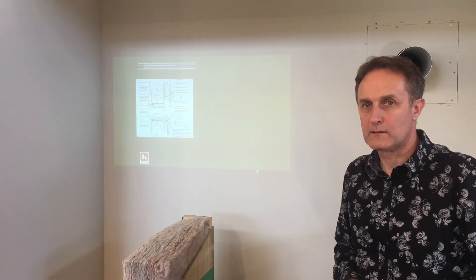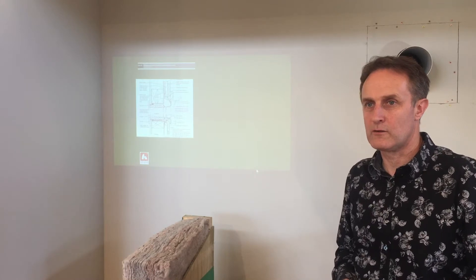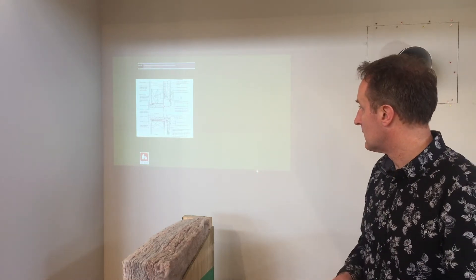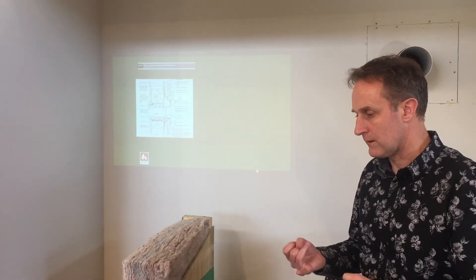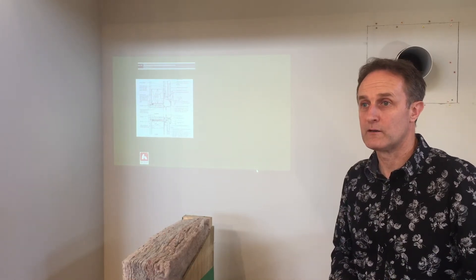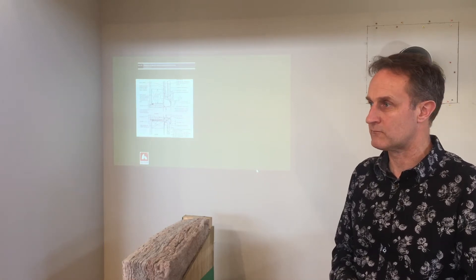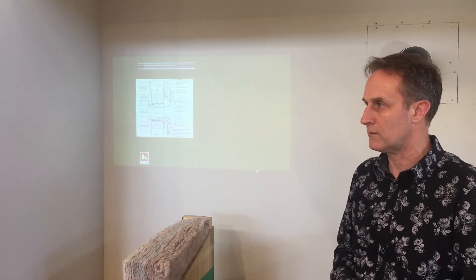In this house the windows are quite heavily recessed — if you look outside there's a big timber return. The reason windows aren't recessed in New Zealand is because the building code tells us to mount them flush, and people are scared of liability for leaky building syndrome. So people don't want to deviate from the standard building code detail. And that is a problem, because you've got a big chunky piece of aluminium sitting underneath the window — a big heat sink, or cold sink.